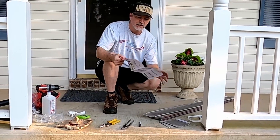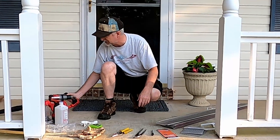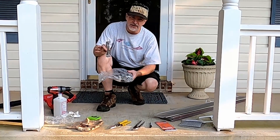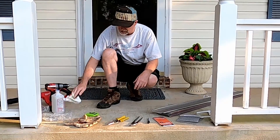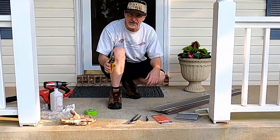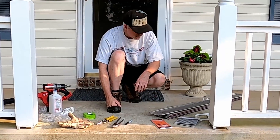They come with installation instructions. Things you're going to need: first of all, you're going to have to clean your gutters, so something to clean them out with. You also need to make sure your gutters are in decent shape — if they're sagging, I've got a video on that, link's in the description. If you're going to use the 3M tape, you want some rubbing alcohol and paper towels or a rag. You'll probably want gloves, a tape measure, and good sharp tin snips — I struggled with those. Maybe some pliers — I'll show you what I'd use them for — and a Sharpie for marking, and a ladder.